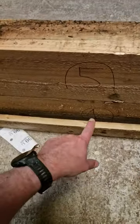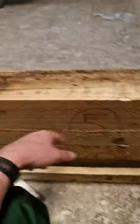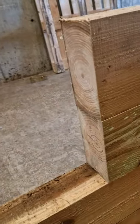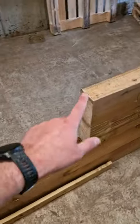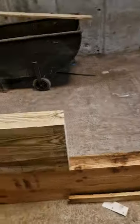Once you install your glass, put blobs of sealant all the way around. We use blobs so water can escape down there — you don't need a full bead. Our sealant's held a ton and a half of sleepers before, so it's strong enough to hold a 40-kilo window no problem. Get your blobs on, sit the glass on top and push it on. Use little clamps if we have them in stock to hold it in place. While the sealant's still squishy, get your spirit level on top of the glass to make sure it's flat.